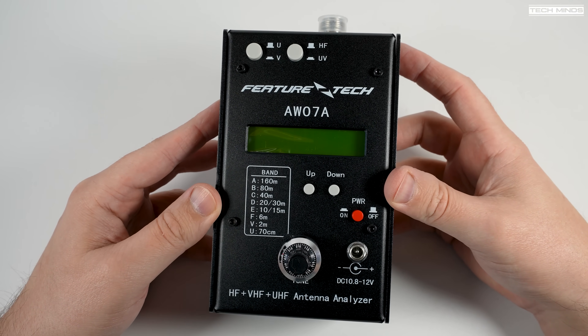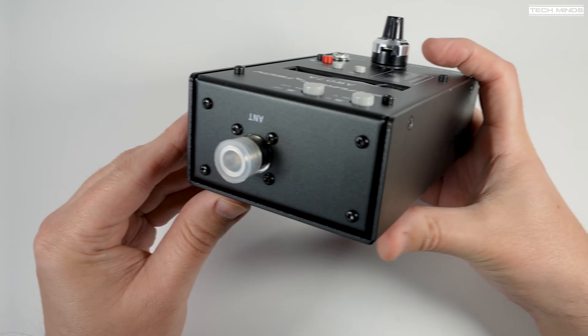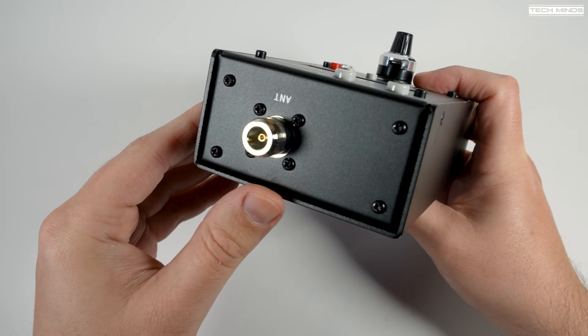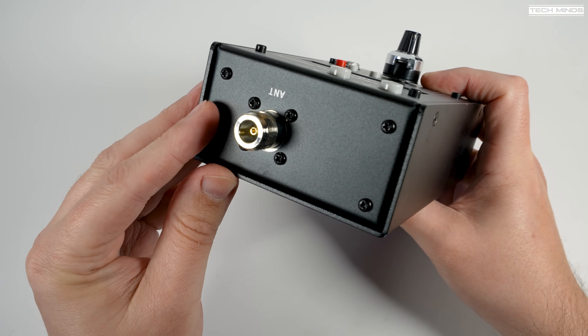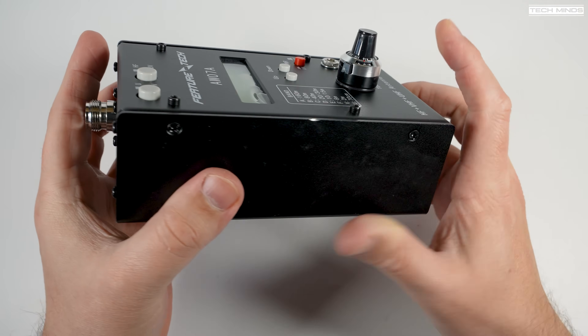In the middle there's a backlit display where all of the live readings are shown. What I was surprised about was that the antenna connection on the top is actually an N-type rather than the regular SO239 you'd probably expect. I guess they thought about performance when hitting those 70 centimeter frequencies up at around 430 megahertz, as N-type is the correct connector to use for that band.